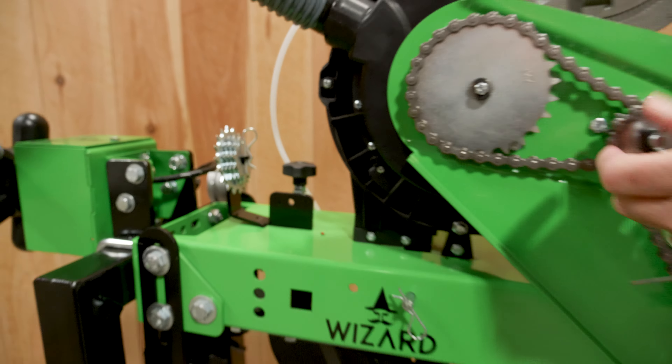Now I'm going to show you the system in operation. I've got some sorghum or millet seed here and you put it in the hopper. This hopper works well for all these different sizes, but there's also a 15-liter hopper — a bit bigger — available as a purchase option. I'm going to run the seeds — you can look right in here — and I'll turn on the fan. You can see that first seed came right up there. As they're coming through you can see they're almost getting bumped off.